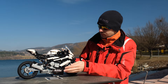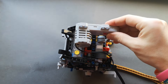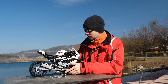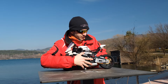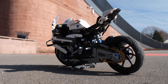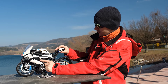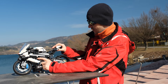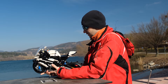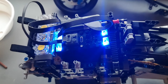One of the biggest challenges was actually fitting the motor. The motor is placed inside here, under where the original gearbox used to be, and it drives the chain which drives the rear wheel. The motor also drives the fake engine — I wanted to preserve that functionality. We are also using one additional motor which is supposed to move the center of gravity left and right.